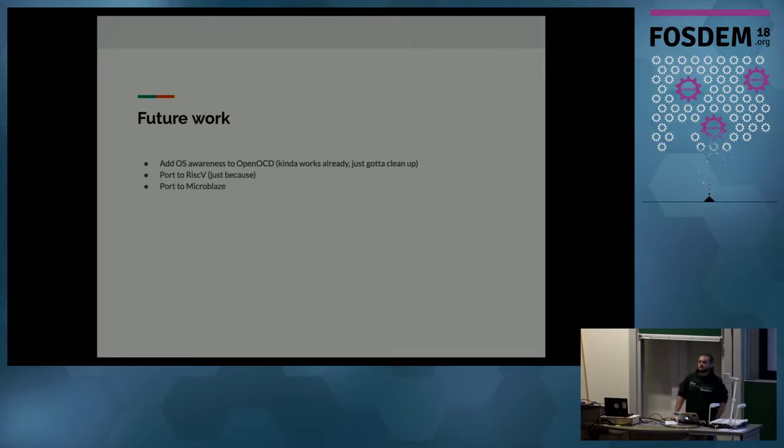So the question was, at what point does an RTOS make sense versus running bare metal, just having a while loop that goes through all the tasks? All right. That's a bit a difficult one. It depends, A, on the complexity of the system, I would say. If you're working all alone, you don't have colleagues, and you don't share the work, for example, it gets easier if you have an RTOS because you can package out work packages between people.